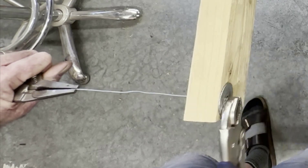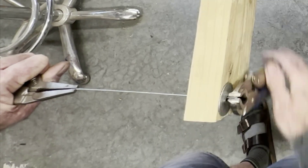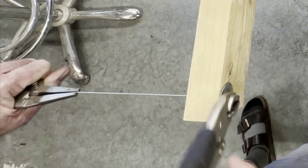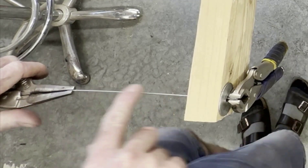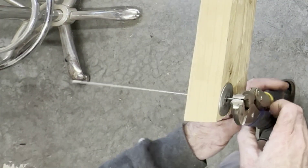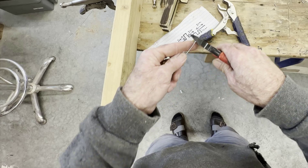As I start to spin this, it'll get straight. You can do this with a drill - it's actually a lot of fun with a drill - but it's also kind of awkward loading the wire in every time. It's pretty easy with locking pliers and you don't need any power equipment. If you do it too much, it'll start to get striated like a cream horn. So undo that one, then undo this one - no matter how careful I am I always seem to tweak the ends a little bit.